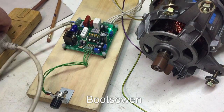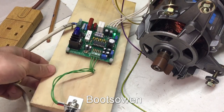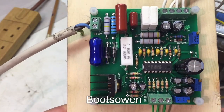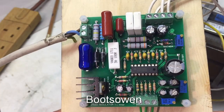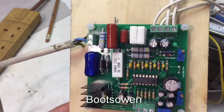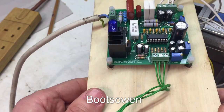Let's unplug it again. I've got a closer look at this board. It says it's an AC commutator motor speed regulator, which is what we know it is. It's based on the TDA1085C chip — that's this chip here. And it's made by MU Design, or maybe the board is printed by MU Design, or that's an online thing. But it's a Russian eBay job.